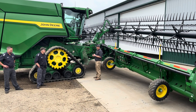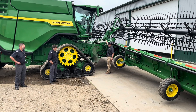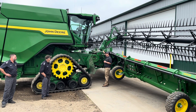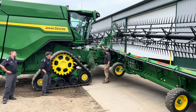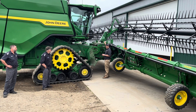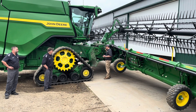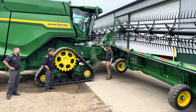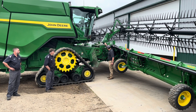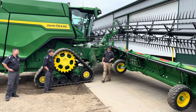This is a 50-footer — we don't have 50-foot for S series. However, for 45s, 40s, and 35s, there are adapter kits. Since the feeder house on X series is wider, a 45, 40, or 35 HD or RDF can fit both an X and an S series. There are attachment plates that bolt on and compensate for the wider feeder house. There's also an electrical pin connector changeover. The process takes about 15 minutes to get the brackets in place, bolt it, and you're ready to go.